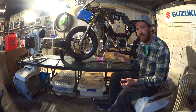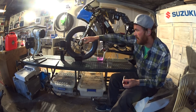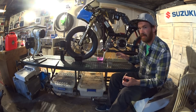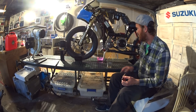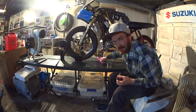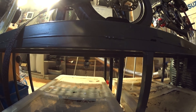The frame. The main part of the frame is this long piece of square tubing going all the way from the motor to the front of the dyno. The pieces on either side are just there for support for your legs or floorboards, so the dyno is fully functional without them. It's this central piece that's transferring all the load. For my front wheel mount, it's a slightly larger piece of square tubing that slides over this piece and is fastened with three bolts below the deck, so I can loosen those bolts, move the front wheel to the location I want, and lock it down.